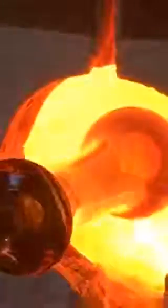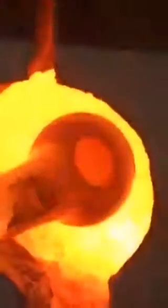It's going to change the shape a little bit. Now we're changing the shape of the glass, and then quickly — you can see the way I'm going to heat it up. I'm going to flare open the lip and then let gravity, as I hang it down, create the folds of the vase. If there are any questions please feel free to ask. Watch — I'm using centrifugal force to open it up.